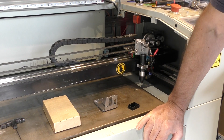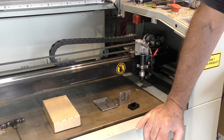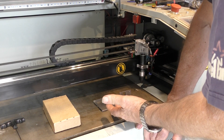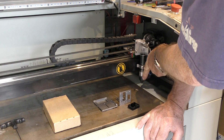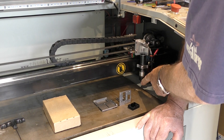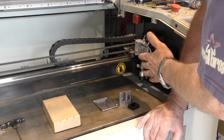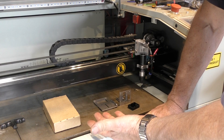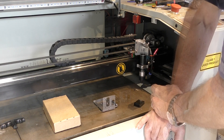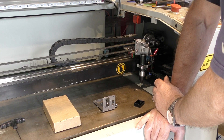It'll be fairly simple to design an acrylic bracket instead of this steel bracket, but when I sat down and tried to achieve it I'm extremely worried that there is not enough rigidity in the bracket itself — even though I manufactured it from five millimeter acrylic — because of this dimension here where we're getting a lot of pendulum risk. We've got mass at the bottom which is trying to swing around when you accelerate this head backwards and forwards. The whole point of this lightweight head is so that you can change the settings and make it go really fast — you can put the accelerations up from 3,000 to 30,000 for example. Unfortunately I couldn't design a risk-free acrylic bracket to do the job.